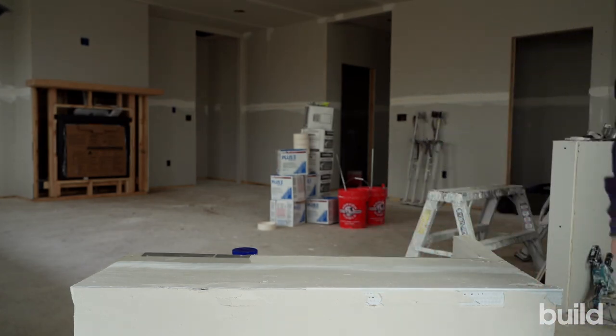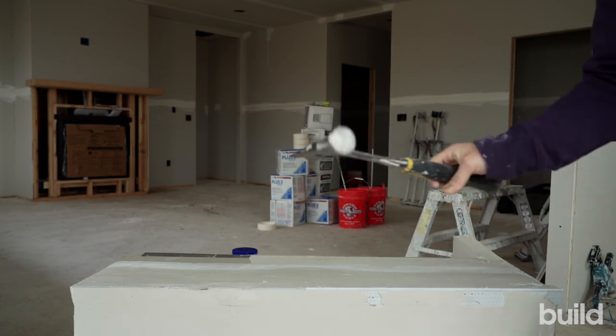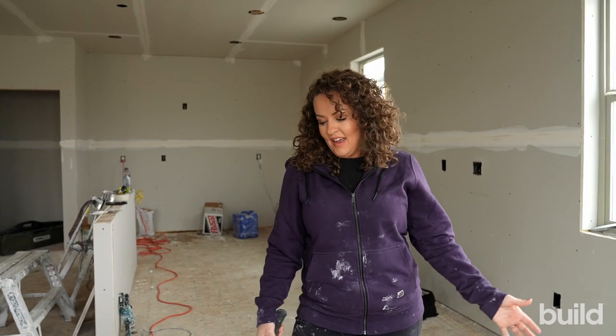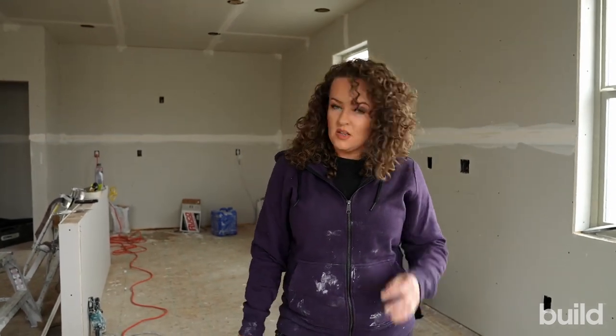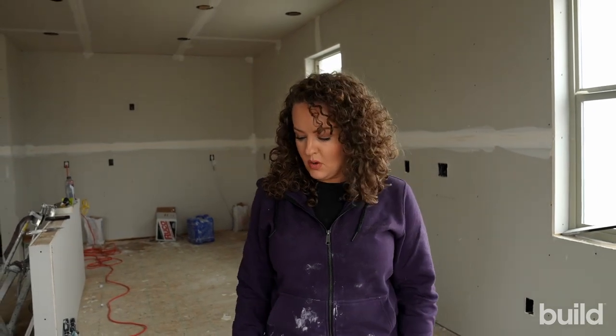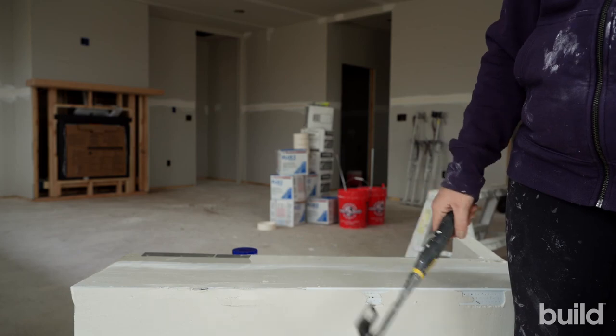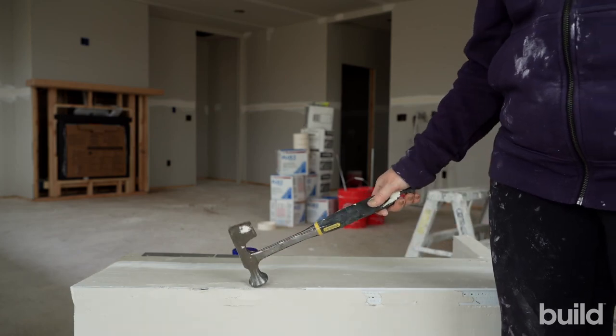It's still right there, still completely round, and I was hitting it hard with a hammer — you guys saw what it did to the metal bead. So I think it stands clear which is the better choice here. The vinyl is very fixable — it took some damage but absolutely fixable in a couple of minutes. The metal one, you're ripping the whole piece off. It's completely destroyed, and you've turned something simple into a big patch and a big repair.